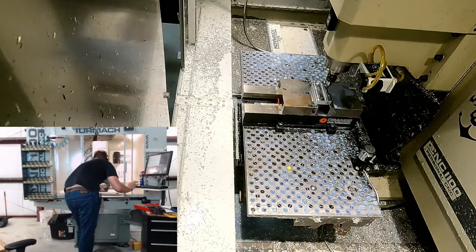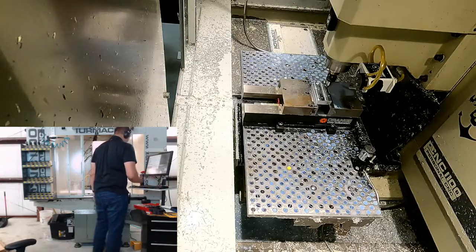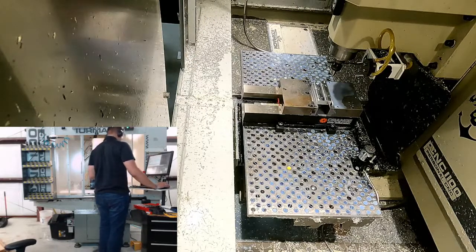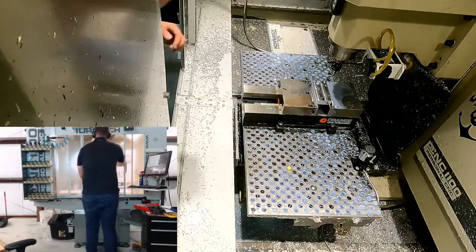That was quick. Okay. Well, that makes sense. That's indicated still at 0.1001 because that's the non-movable side of our jaw. So I could have saved some time there and only indicated X. Which is why if we had a stop, you wouldn't even have to do this step. But remind me to do that for the next part if you watch that one, the Titan 2M.